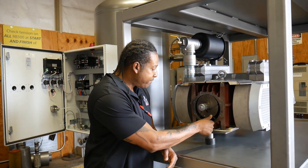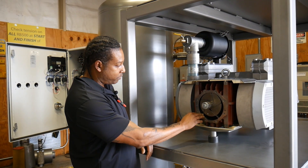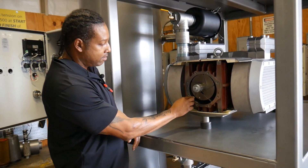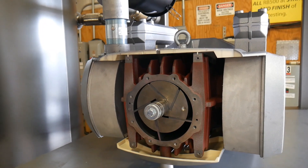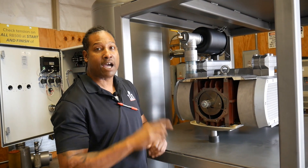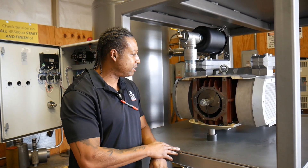When you get into a situation where the vane is too short — you can kind of see here — if it's too short, the vane will actually get trapped and when it comes back to this small space, it'll actually break. So you have to really be on top of the minimum vane height to make sure that doesn't happen. Depending on usage, it's usually somewhere around a year and a half to two years before you'll have to replace these vanes.